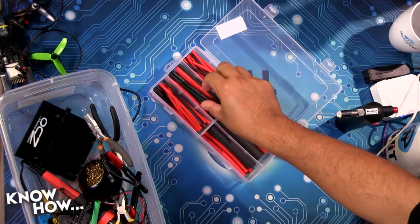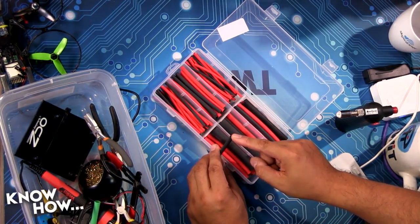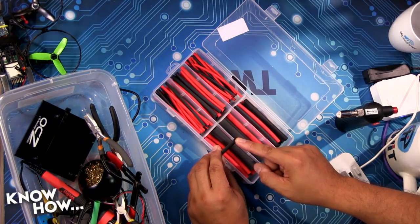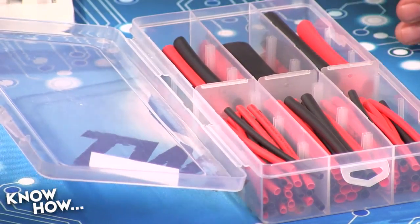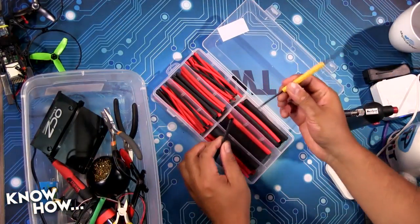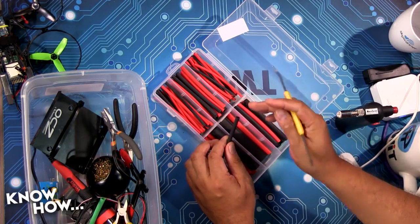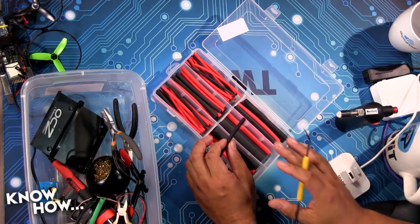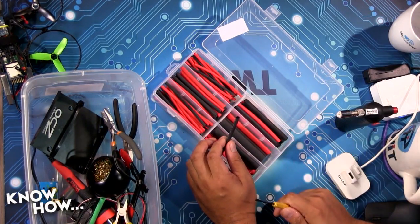Here's the difference. Inside each of these heat shrink tubes, there's a heat activated adhesive. Oh yeah, it's really shiny. It's super shiny. Now it's not sticky. I can put things into this tube, and I can't drag out any adhesive. You won't feel any of that. No. It only gets sticky once it starts getting hot. Right. It gets moist, it gets wet. Then it sticks to things. Yeah, that makes sense.